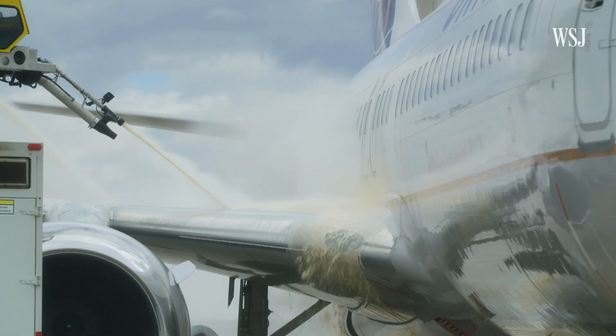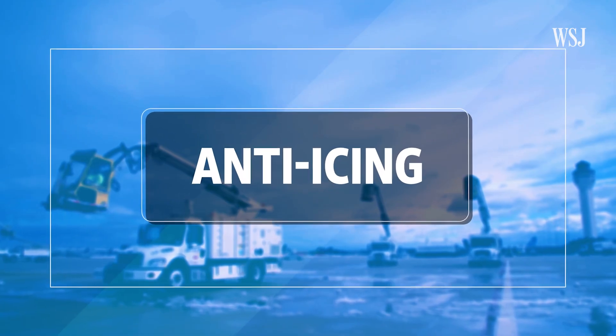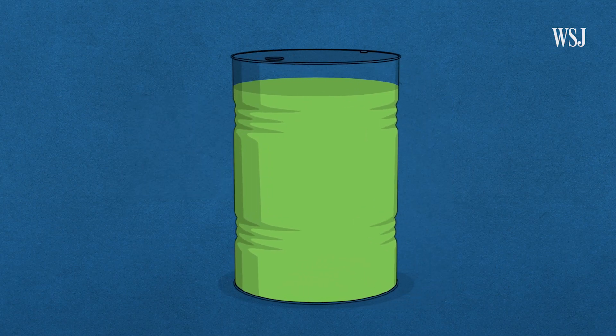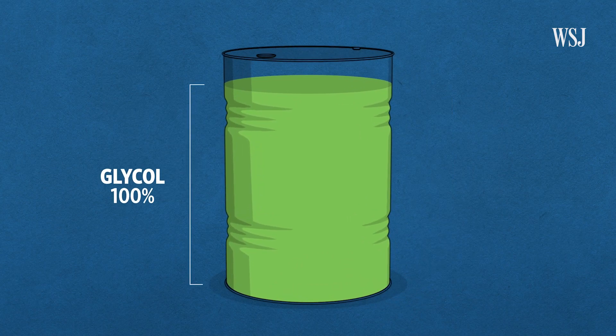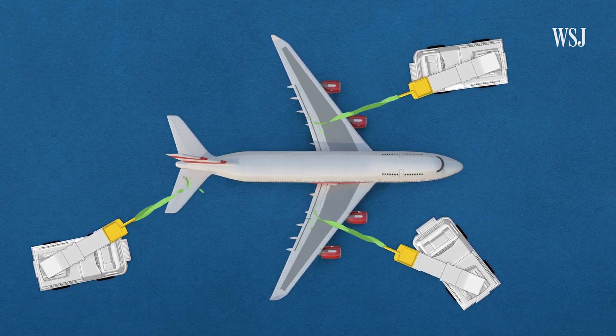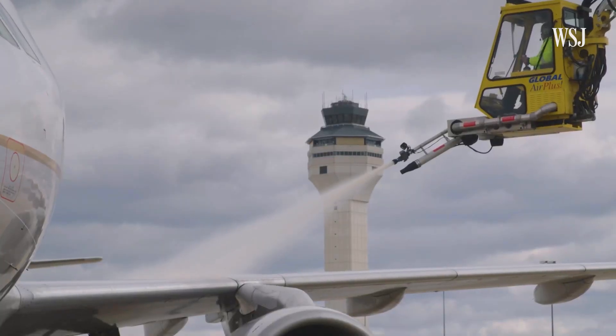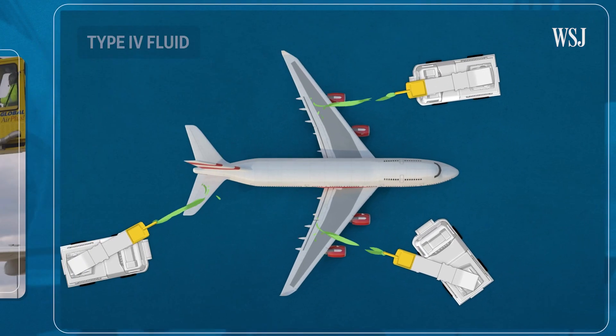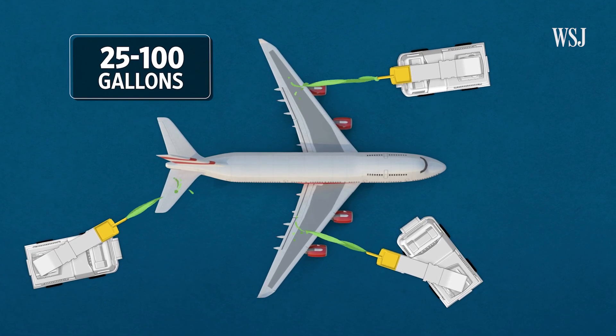But not with this orange stuff. Anytime there's precipitation coming down, after we've cleaned the aircraft, we always want to go back and anti-ice the aircraft — and that's using type 4 fluid. Type 4's most noticeable difference from type 1? It's green. Decker's team also uses a mixture that's 100% glycol, and they put it on the aircraft cold. It's thick, but you don't cover the entire airplane — you just cover critical surfaces, which are your wings and your tail. If type 1 is a cleaner, type 4 is a protective coating against the falling precipitation, meant to keep new ice from forming on the aircraft. And it only takes about 25 to 100 gallons of type 4 to do the job.